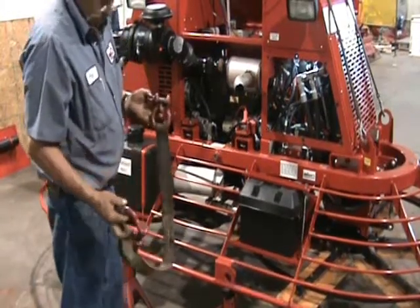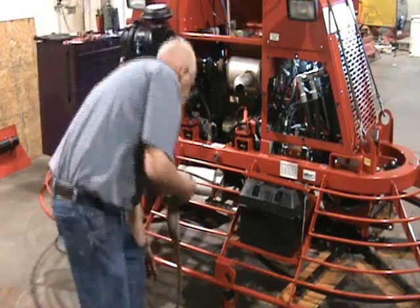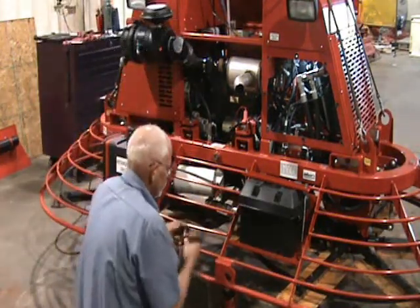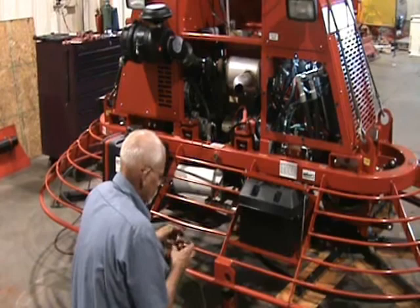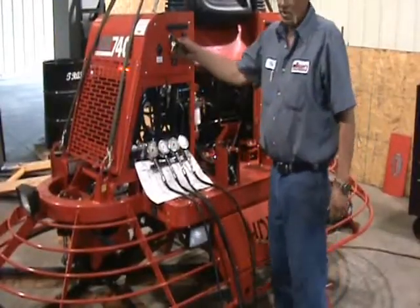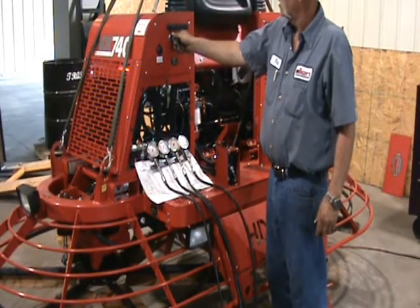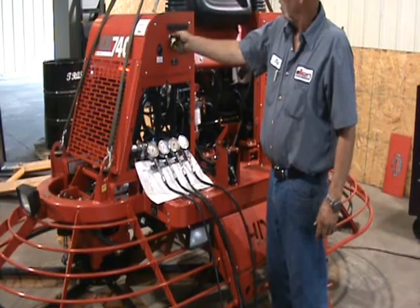This is what we're using when we lock our rotors together. You can use something similar — a chain, anything that has a safety device on it where it's not going to fall off or get tangled up. Now that we've got our safety strap on there to do the lock rotors, we're going to start the engine and ease it around until it's taut.